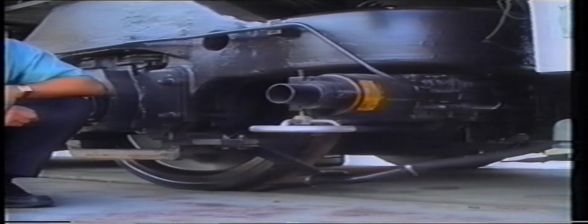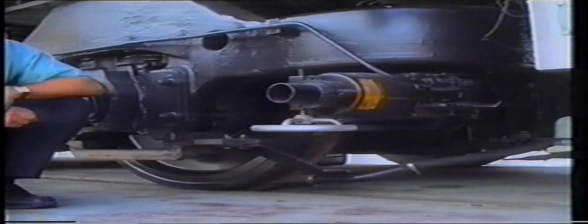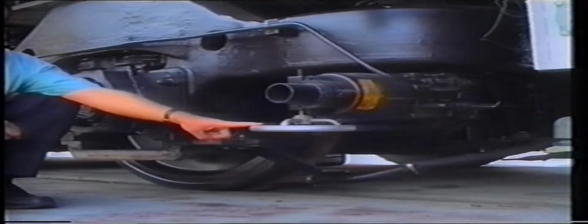There are 2 park brake cylinders on each bogie, located in diagonally opposite corners. When no air pressure is present, the spring park brake will apply. To manually release the brake, the handle underneath is rotated.